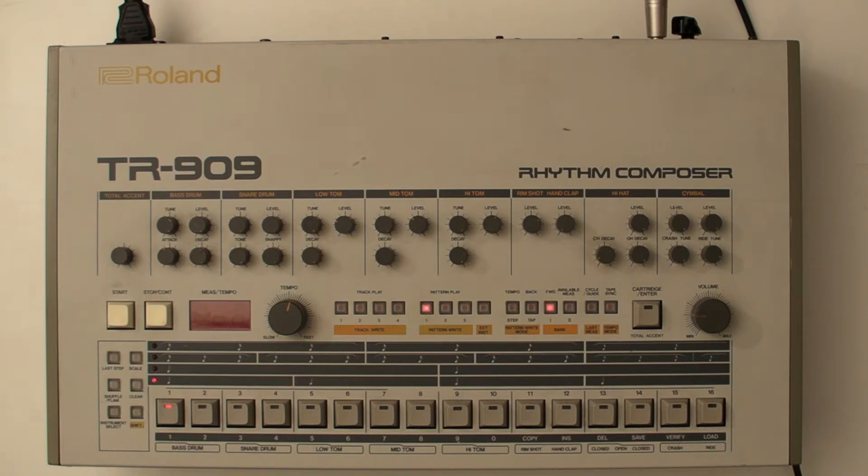This is a TR909. The owner had tried to upgrade to version 4 ROM and made a bit of a mess of the board. In the course of repairing the board, I replaced the original 8K RAM chip with a 32K FRAM chip. It's four times the size, so I put a four-way bank selector switch up here on the back, so there would be four times the total memory for patterns.